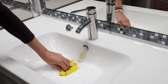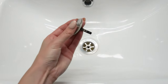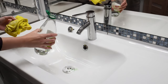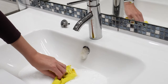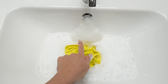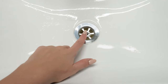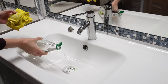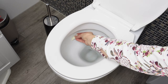Express trick for cleaning the drain — it will thoroughly clean the pipes in 5 seconds. Remove the plug from the drain. Pour in 4 tablespoons of baking soda. Add 1 tablespoon of dishwashing liquid, then pour a cup of vinegar. When the ingredients start foaming, press them with a towel. The foaming will fill the pipes and flush out the limescale and dirt. Foam should start coming out of the overflow hole, covered in sludge and rust. This is the fastest and most thorough way to clean the drain. Baking soda and vinegar have descaling and cleaning properties — just two ingredients are enough to get rid of the annoying problem.